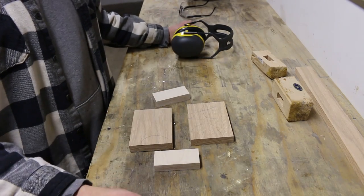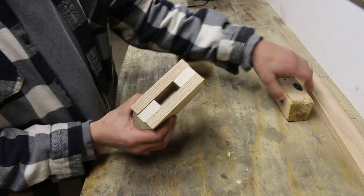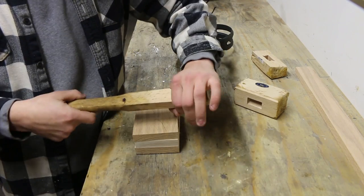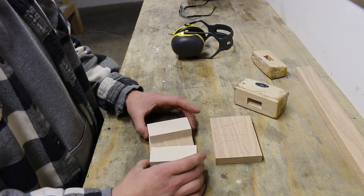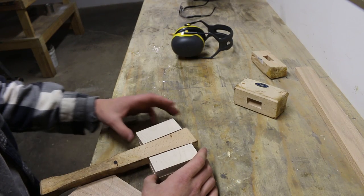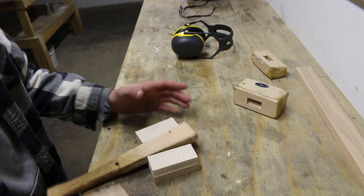I've got all my pieces cut out - my two pieces of oak and my two pieces of maple. This is kind of gonna be the way it fits together, so you have that little bit of a gap just like on the original head. The hole is tapered in the head so that the tapered handle has a friction fit on the inside. I'm gonna taper or angle my pieces of maple, going off reference with this first handle - I'll trace it out and cut the exact same handle. I could reuse it, but I kind of want to make my own. So this will all be getting glued together kind of like that.